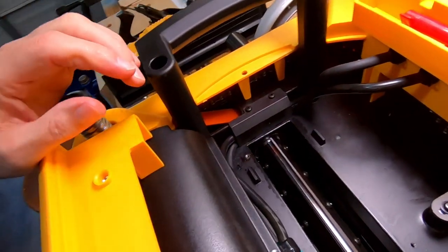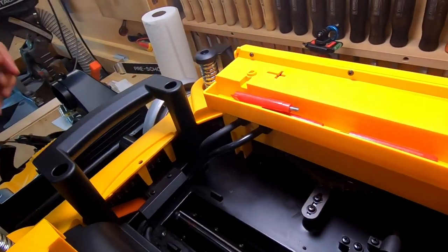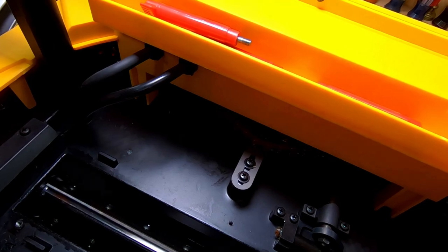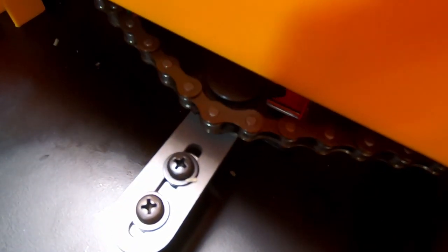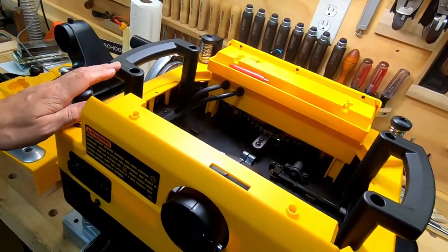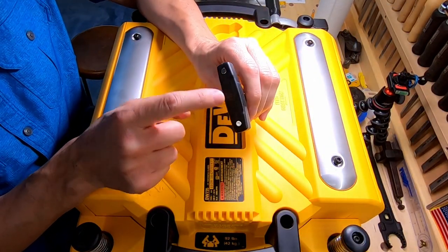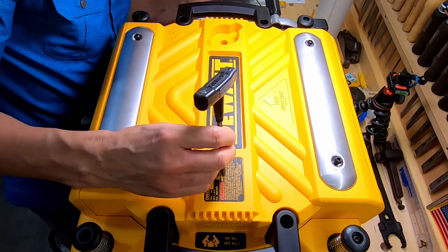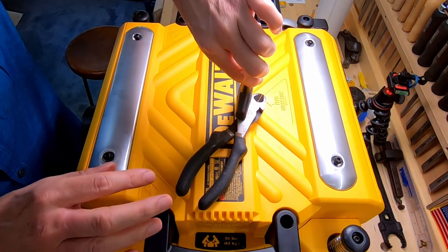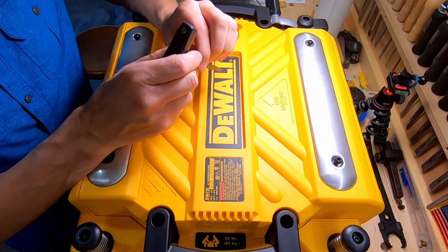This is actually the fan motor and the drive motor — you can see the belt right here that goes down to run the cutter head. And there is a chain drive back in here. Watch as I spin the height adjustment handle — see that chain move? That's your height adjustment chain. That's what keeps all four height adjusters synchronized so your height stays perfectly parallel to your table. Also, these are magnets — you actually use these when you are changing the blades, to pull your blades in and out while you're down in there.